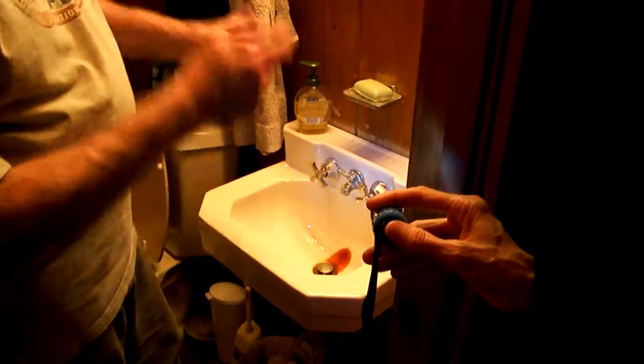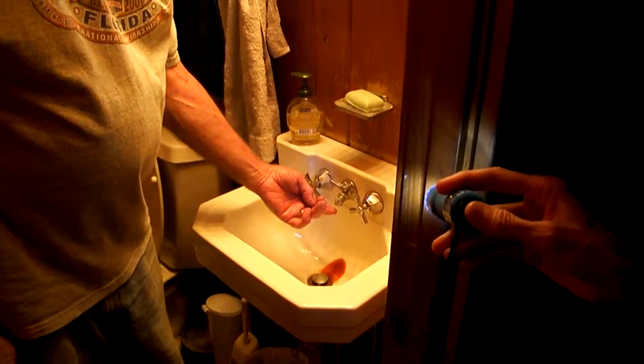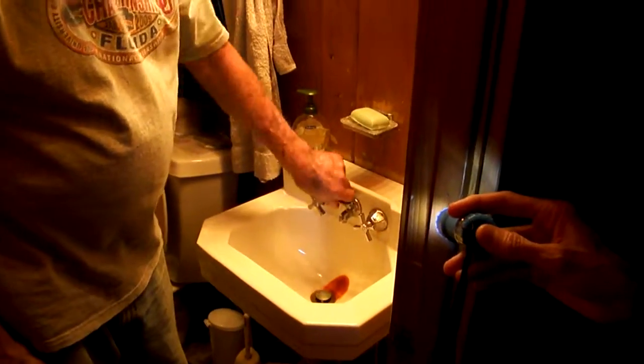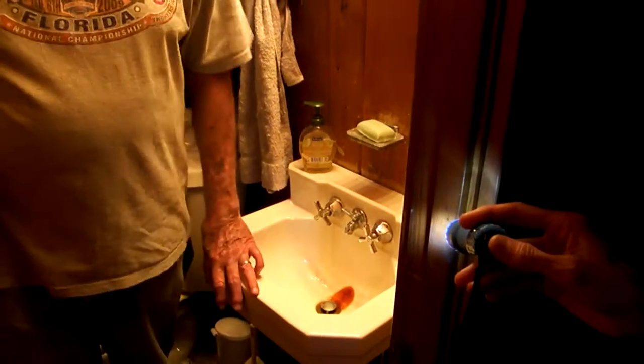Down the drain and you get the U — the trap. You blow air back through the spouts here and the same in the kitchen. With a compressor? And you don't want to forget, you have to put some antifreeze down on the floor drain of the shower. And same thing with the shower head — blow that as well.